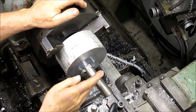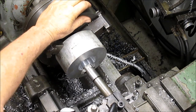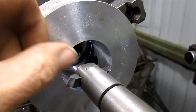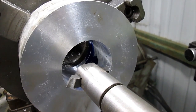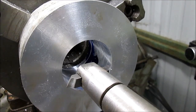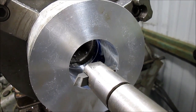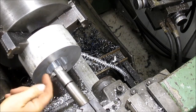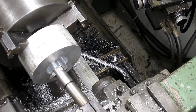The next step in this little operation is to bore this out about another quarter inch to 2 inches 676. I've marked on the inside where we're going to go — about 320 thousandths from the other end. Now if I remember correctly, the other end isn't a machined surface just yet, so we better recheck that. We're going to go just short of that line because we probably have to machine the back end first.